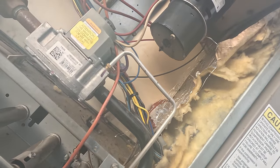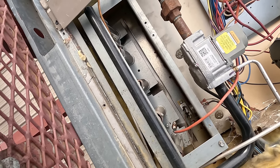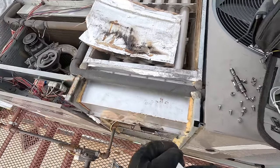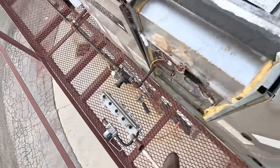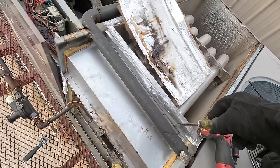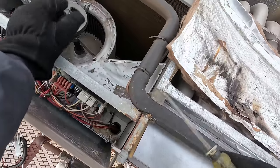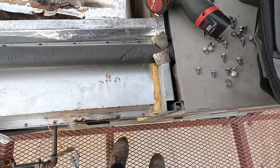It does if you completely block it out. I don't know — that's going to turn into a total wreck. Now that I know one of the heat exchangers has already been replaced, what do you do? It's running, leave it run. There are a million screws and it looks like you can get in there and maybe see the top — the top's not sooted as bad, we might be able to do something with this. LuxAir — no wonder why they're the Goodman of the group. They've got screws all along the side and then a plate blocking it. No thought process at all.